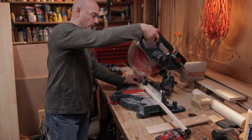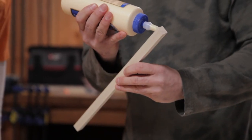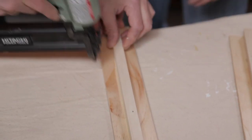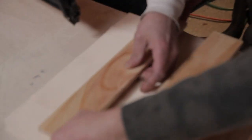Let's start by assembling the glass rack. Use a miter saw to cut the pieces to length, apply wood glue to each dowel and center them on the lattice. Use a pneumatic nailer to tack them in place, glue the glass racks on the lines, then tack them in place.